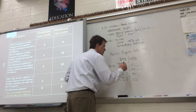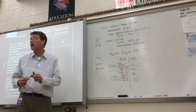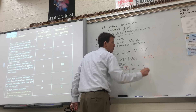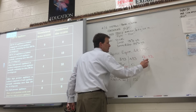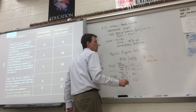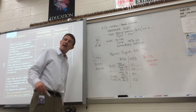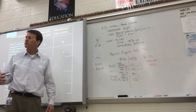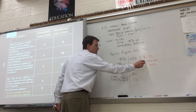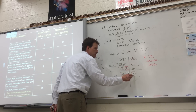They might not give you specific numbers — they might just say more or less than 200 pounds. Example: an old R12 walk-in cooler with 60 pounds of refrigerant, and brand new recovery equipment manufactured in 2016. What vacuum level does that equipment need to get down to before opening for repair? Ten inches of mercury — because it's after 93, it's an other refrigerant, and 60 pounds is less than 200.